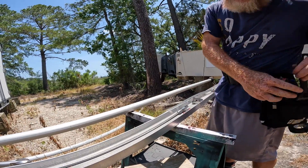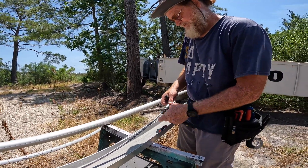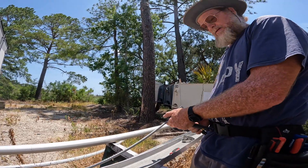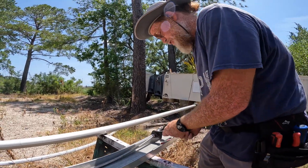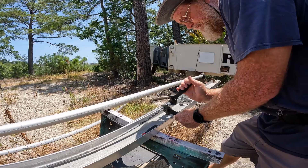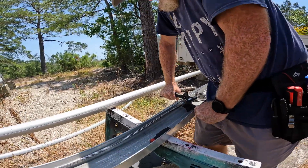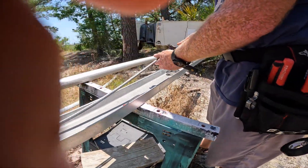When I put this in I should be able to get the first thread started. Once I get the first thread started, I take two crescent wrenches and just tighten that thing down a lot. What I'm feeling for is a clicking — if I'm turning this and I feel it going click click click, I have to stop and back up because that means I got one in the slot. This should not be in the slot, this should be free. This is a large diameter cable so I'll do the final tightening with a bigger wrench.